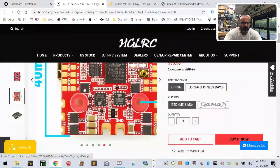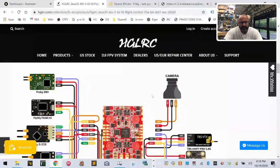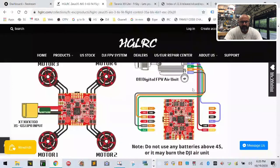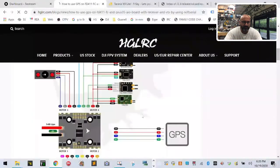I'm interested in this right here. I need to see this label — let me see if I can zoom in. It says S5. I'm curious because I'm looking at this S5 and thinking I may be able to tap into this one and make it a soft serial, because I don't think there's any other open pads here. This is kind of out of space.